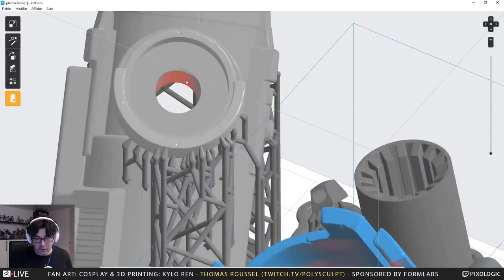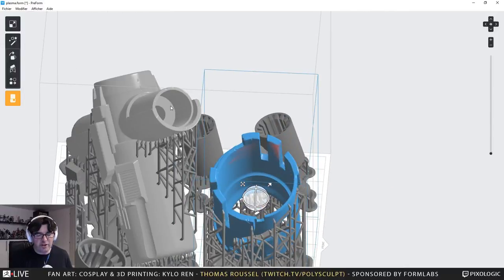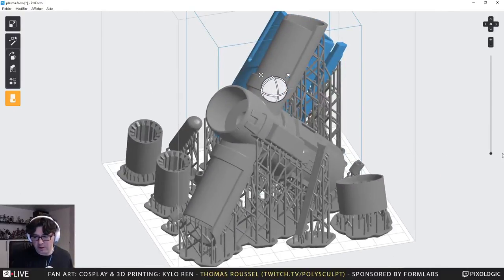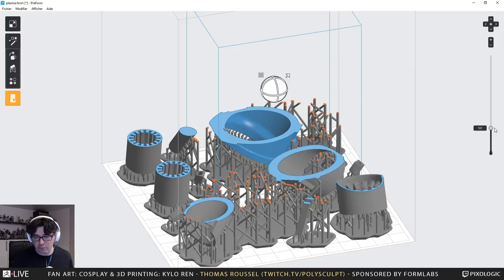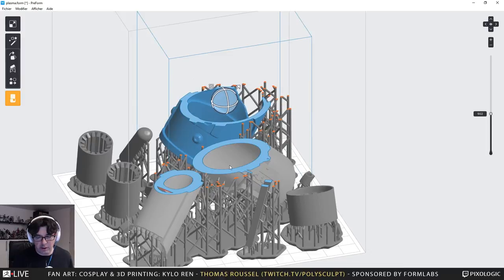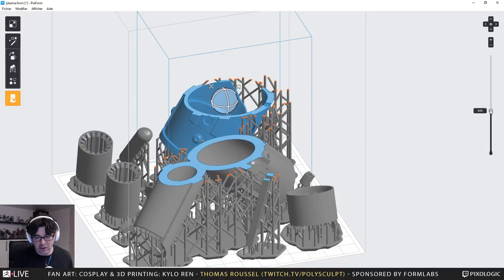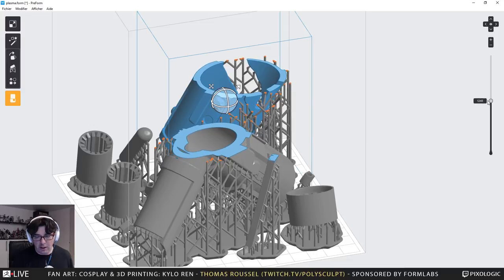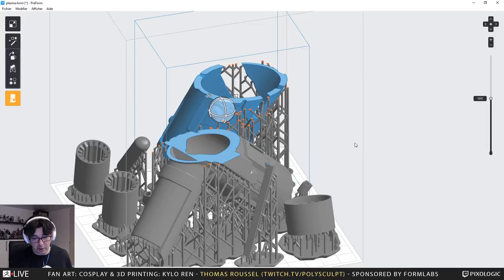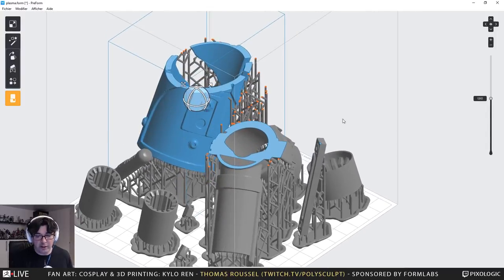Then you have a little bit of overhang, but it was not a problem if the model had a little bit of not perfectly printed areas inside of the model. I know by running the slicer, I mean, not to slice the model, but just to see the progress of what the printer will do. Then for each model separately, one by one, I'm always checking each layer, to see if I will have any kind of problems printing my model, especially if there is some suction cup, or some overhangs or parts growing without being connected to supports.